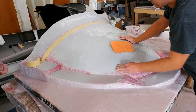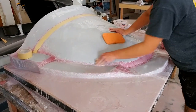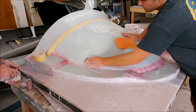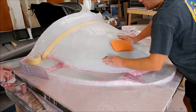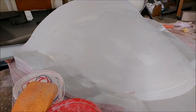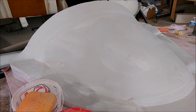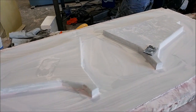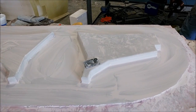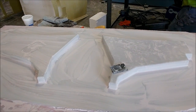And there's the nose compartment door getting its sanding — the guys are just flying through this stuff. In fact they're so fast that I miss some of the video of their progress. The nose door looks pretty much all done. There are a couple of little spots that need to be filled, then it'll go to 320, then 400, then wax. Likewise with the braces that support the glare shield — those have basically been sanded again.